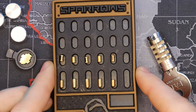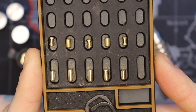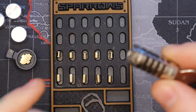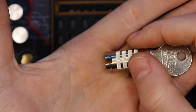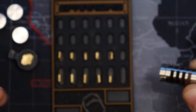You can see that we have mainly three spools, four driver pins — two standard — and all the key pins are standard pins. This is our ASSA Profi One Star. Be aware when gutting it that the plug does have these segmented areas in here, so if you're trying to pull it out, be careful not to have it sideways to get anything caught in it.